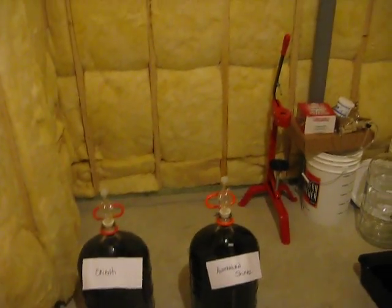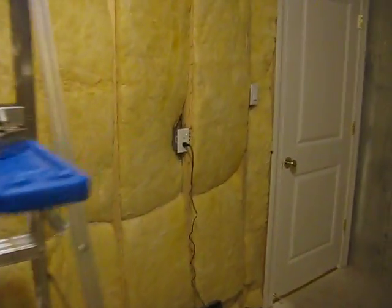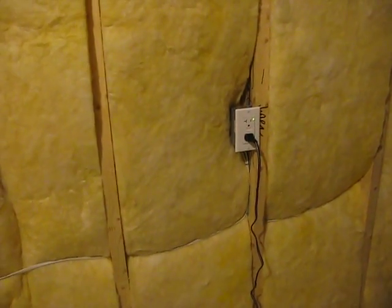Electrical is going to be an issue. I'm not an electrician at all. I'm planning on installing the outlets. I need an outlet here, at counter height. This GFI outlet I want to drop down to floor level, and I'm not going to make it a GFI. I'm going to change it to a normal outlet since we're going to finish this space.